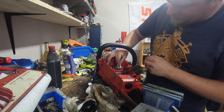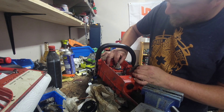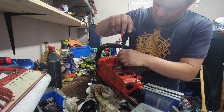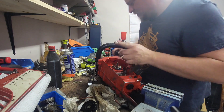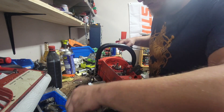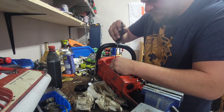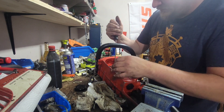Those blue Prestolite coils are horrible and notorious for failing. Like the saw I'm going to send to JK eventually - that Super XL 130 - it currently has a blue coil. I've baked that coil but I'm having problems starting that saw. I don't think it's the carburetor; I think the coil is only working intermittently, which makes a lot of sense because that's what they do. As far as chainsaw coils go, those are kind of the problem ones in the chainsaw coil world.